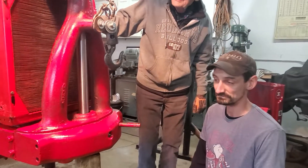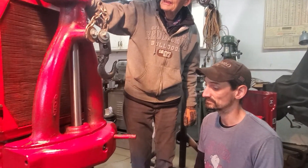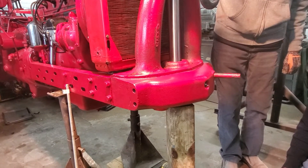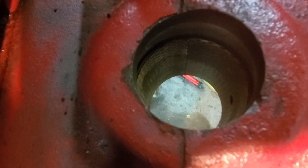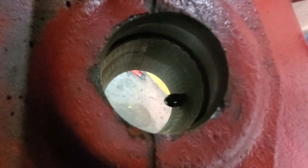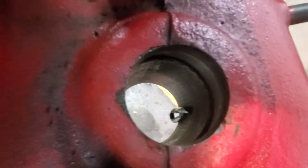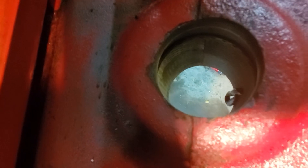We will remove the bolster now and work on the upper shaft. When we remove this bolster, we'll also double check to make sure that the grease port is lined up. Here's a close-up of the bushing inside the bottom bore, and it lines up with the old marks. Adam is pumping grease through actually just to prove that it's still lined up. Perfect — this bottom bushing has been installed. The grease came out. Good deal — the bottom one is in, it didn't give us too much of a fight.